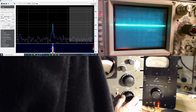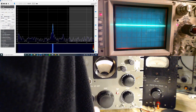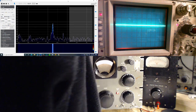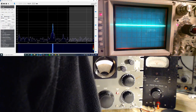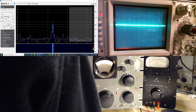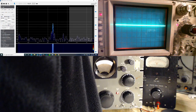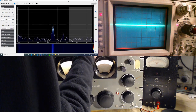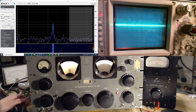Another interesting thing I've noticed with the SDR is that there's lots of times, you see the signal there? Yeah. Okay, that's the radio turned up full blast audio-wise. You can't hear a thing, but you can see it. So sometimes when I'm doing shortwave listening, I'm not even listening. Well, I'm listening, but I'm not paying attention because I can't hear anything. I'm clicking on these tiny little lines on my SDR and checking it, and sure enough, if they're bang on a decade, like 10 megahertz, not 11.2 megahertz. If they're right on 10 megahertz, it's almost certainly an international broadcast if it's in the broadcast band.